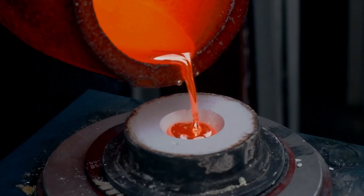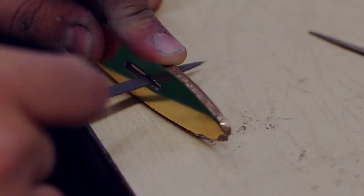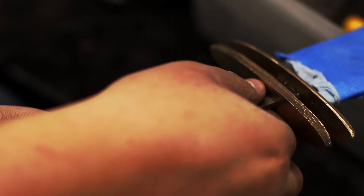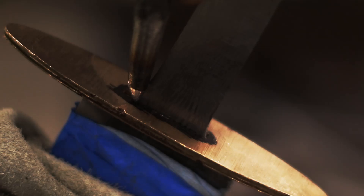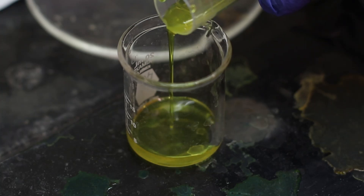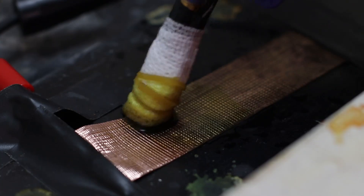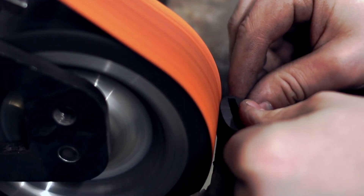3D modeled pommel and plates were printed, molded, and cast in bronze for sections of the handle. After the plates were cast, they were cleaned, polished, and filed. Following this, they were used to enclose a layer of horn and were riveted to make the upper and lower guards. These guard plates, as well as the pommel and the waffle pattern foils, were gold plated with a solution formulated by the team.